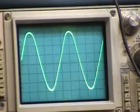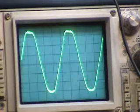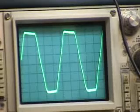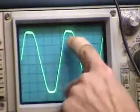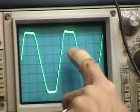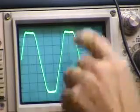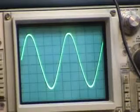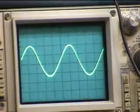And now, just to show you what happens if you keep going, if you keep cranking it, you notice the voltage doesn't go up a lot more. It just continues to clip. And this is the thing about a tube amplifier, is it will seriously clip for you, but it'll have a reasonably rounded knee, as they call it, as opposed to having a very angular edge, which is more common of transistor clipping. Alright? And when I max this thing out all the way up here, we're getting up to maybe 13.2 volts. Alright, so now let's calm the thing down, put it back into a more normal range, and let's look at some of those numbers.